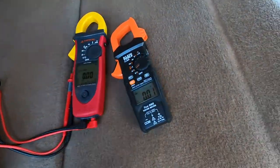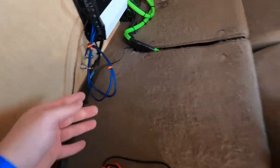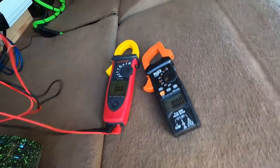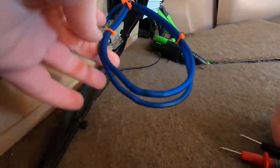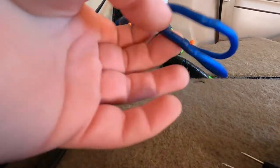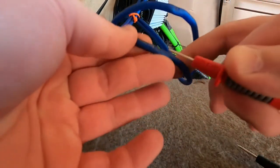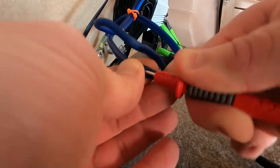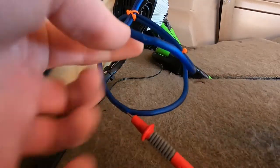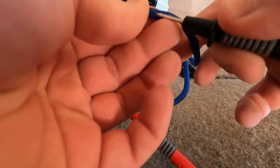I'm going to show you the proper way to hook these up. What we need to read is the AC voltage and AC amperage on the actual speaker wires. You can take the voltage-reading clamp and get the leads over to the speaker wire. Find the positive lead coming out of the amp and insert the probe on an angle through the jacket until it makes contact with the wire. Do the same thing for the other side.